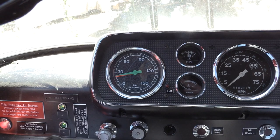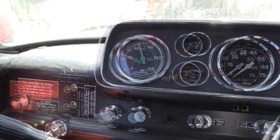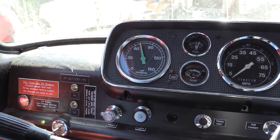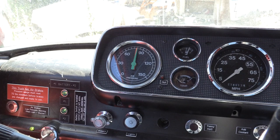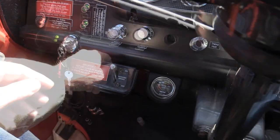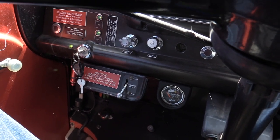You actually have to sit here for quite a few minutes. And you can rev the engine up to have it happen a little faster, but it still takes many minutes to get this up past 70. Once it gets past 70, you're good to go. Now, I suppose in a real firehouse, the way they had these things always on the ready was they had them plugged into air compressors with quick release umbilical cords. You can take the emergency brake off and get on down the road.